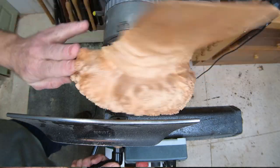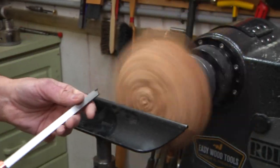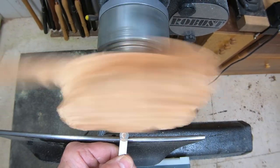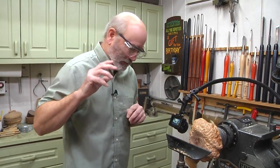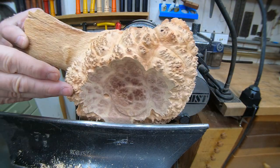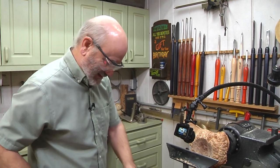I'm going to bring this up a bit more, double check — still good. Turn it on. Now we're on center for making a cut. I'm going to pick the speed up. That sounds interesting, and Brian's staying way over there, so that's good. We're just going to come in and nibble away at the wood, starting to establish how far out we can go to the sides. I've just been gently, gently tickling away the wood. We're not deep yet or wide there, but we're wider here because this part is actually higher. I want to leave enough of the broccoli shape to make it look like broccoli, so I think that's as wide as we're going to go.